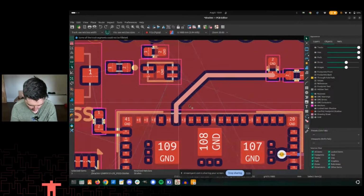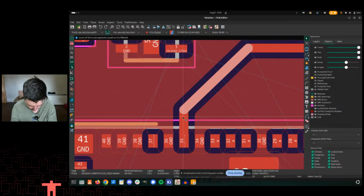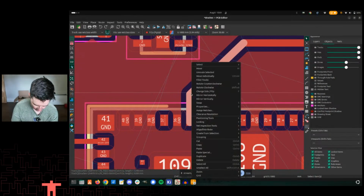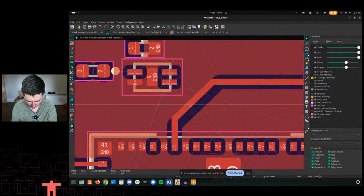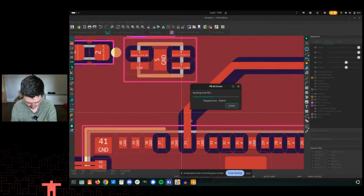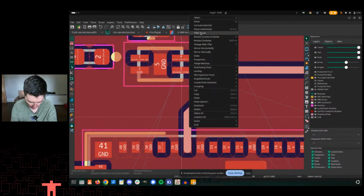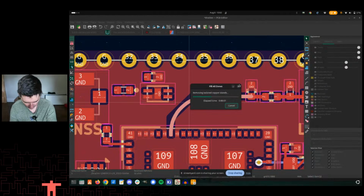Well, that's weird. Oh, I might not be able to make this bend. Yeah, so you need a certain, let's see if it gives an error when I do that. Yeah, unable to fillet because of the size. So basically because this line is, the feed is too high here. Let's try that. Select U, right click, fillet. Let's try 3 now. There we go. Look at that, nice and round.